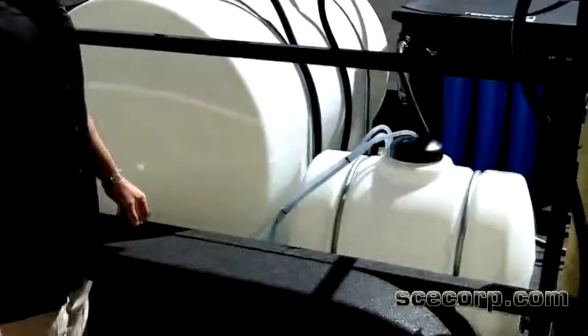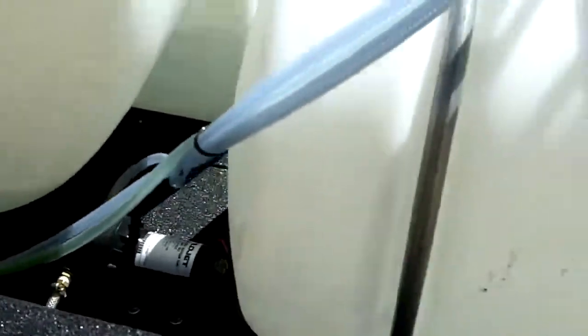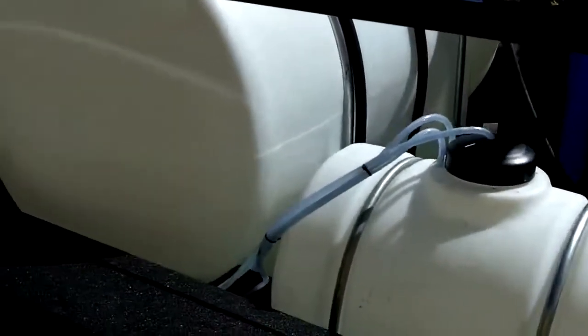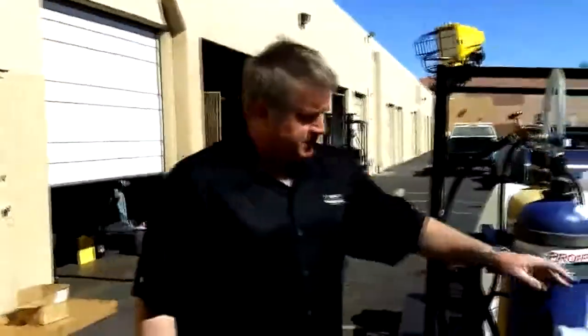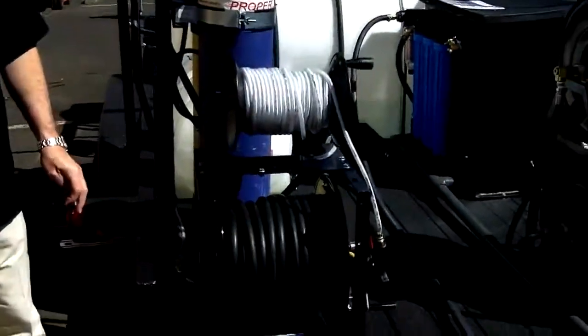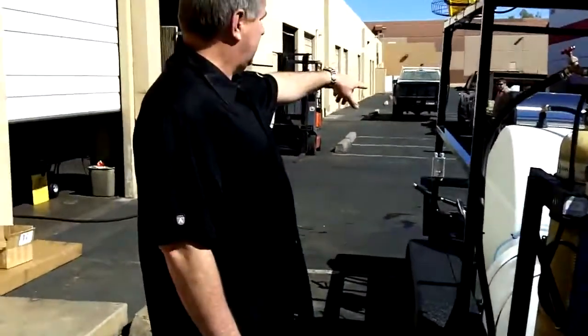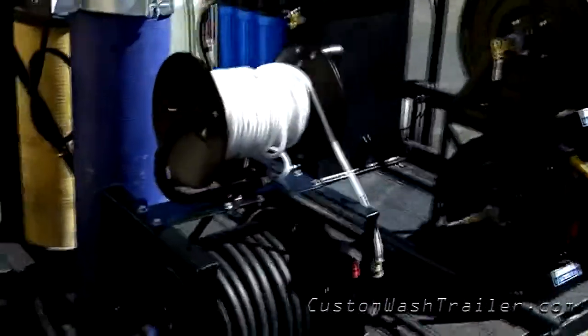We do a lot with chemical tanks. We put a little flow jet pump on here with an on-and-off switch, and then run three lines into it. We're running two downstream injectors so that you can apply chemical downstream from either the hot or cold water washer, and one more line coming back to a chemical reel on the back. If you put soap in there mixed about one-to-two or one-to-four and turn the flow jet pump on, you're applying soap direct — great for trash can areas, heavy-duty staining, degreasing vehicle frames. For regular washing, you run the downstream injector, which dilutes one-to-two or one-to-four and then another fifteen-to-one behind that. So you're able to apply chemical in several different ways and get the job done quicker and more efficiently.